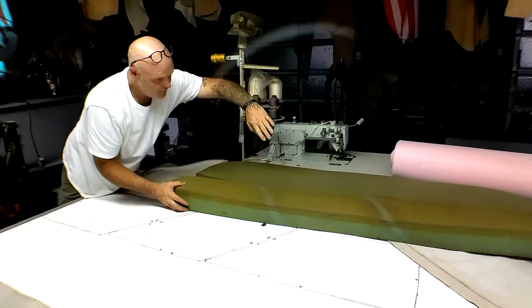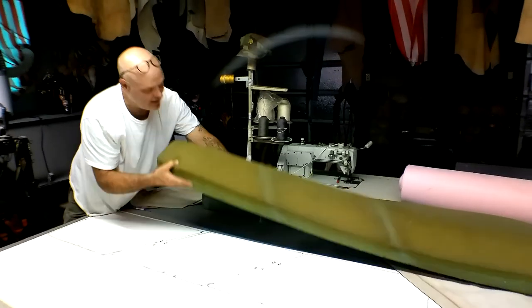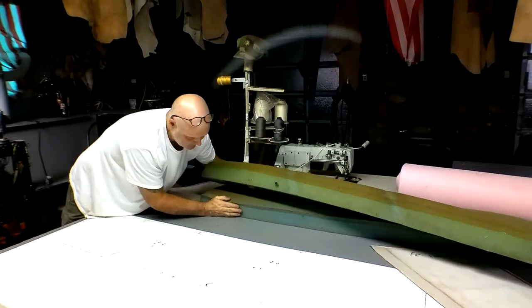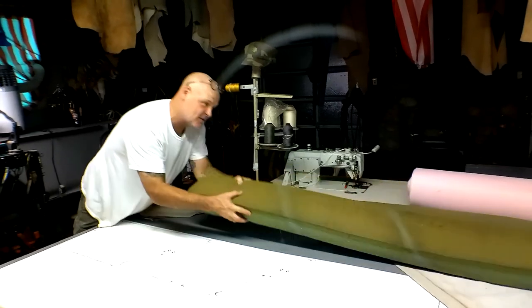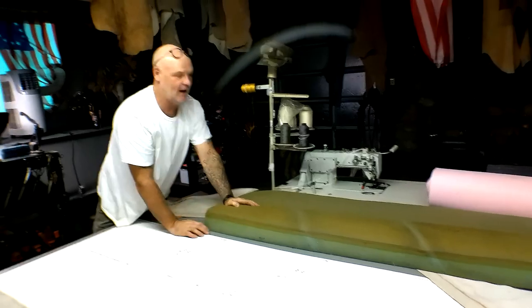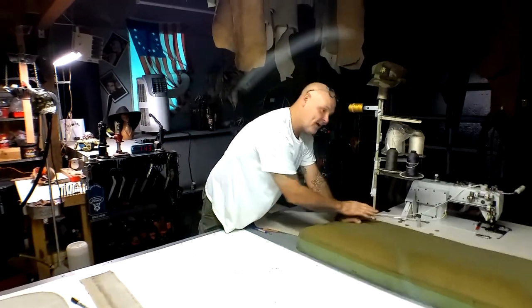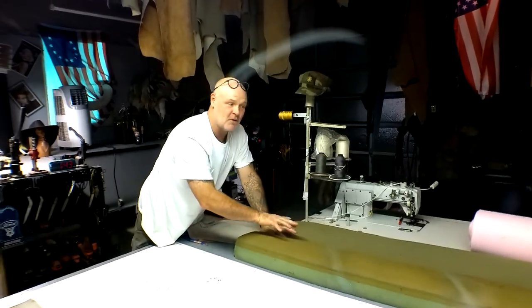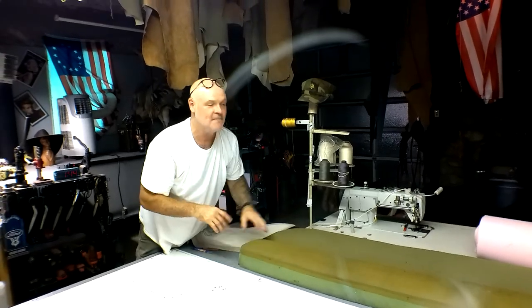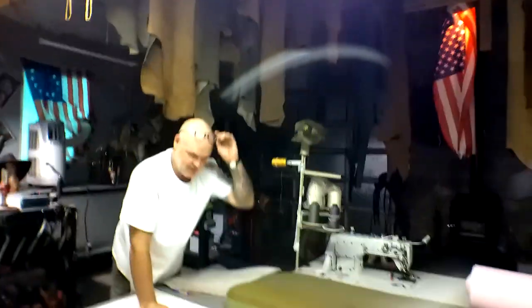And as you upholster this big piece, you anchor that down, staple it down, but don't distort it like they had it. And then you put this on top of that, okay? And then fold the rest of it over. So it goes bink, bink. This is distinguished, and that's why I use scrim, because it gives a little bit more meat in it. You can see the two different pieces of seat. So, and the French seam is purely decorative.